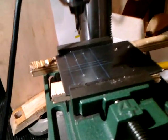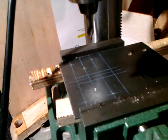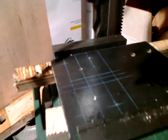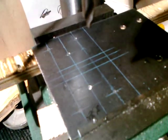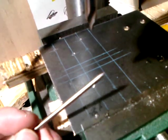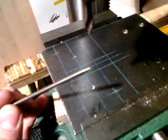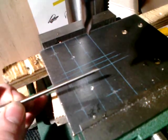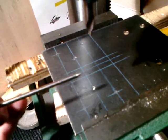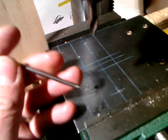Hi, I was drilling these holes in this mounting plate and it occurred to me that this might be a process that people aren't so familiar with. What I've done here is I went ahead and laid out what I wanted to make on this piece of steel, and then I took this — what I'm going to call a prick punch. It's an eighth inch diameter and I sharpened it to a nice sharp point on the grinder. This is made from an old aircraft drill bit — it's a really really good steel.